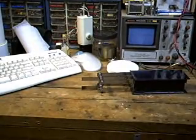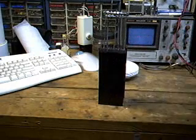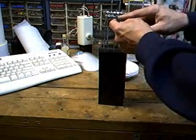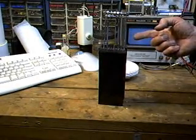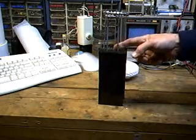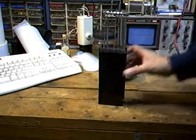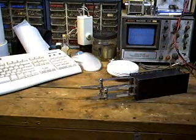The other point I wanted to make is this: when you're drilling the holes, I had this standing vertically and I was deburring the holes after I had drilled them. A couple of chips fell inside the plates, and with gap spacing this close, that could have been a disaster. Fortunately, I was able to blow it out with compressed air and there are no short circuits in here. So when you're deburring the holes, leave it sideways. Take it from somebody who learned the hard way.